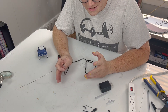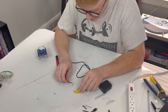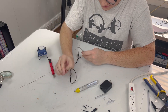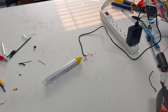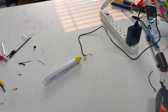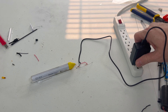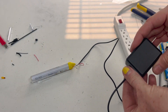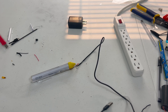I think to test this thing, I'm just going to leave it laying on the solder, and if it melts, that means it's getting hot enough. Then we can actually try holding it and soldering something. Here's our test setup — we've got our soldering iron, our power strip, phone charger, soldering iron. Take one. Literally nothing happened. For some reason the little DC power supply I had started clicking and buzzing, which was kind of weird, but the wire literally didn't heat up at all. Now on the tip of the solder we're getting 76.6 degrees. This seems to be doing a whole lot of nothing. I'm going to swap the USB block — maybe this one has overcurrent protection or something dumb — and we'll see if an even crappier one works.